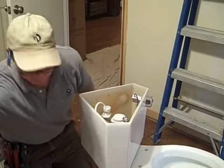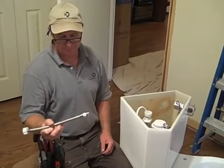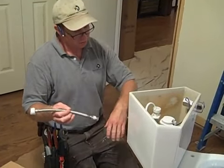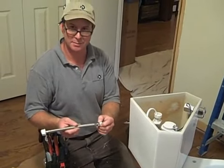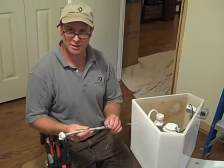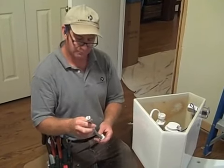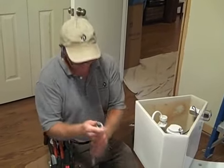The other thing we'll do while we've got the toilet sitting out here is attach the supply line. This is a supply line that prevents catastrophic flooding. Should this toilet run and run and run and overflow, or a line break, this has a little check valve in here that will stop water from coming out after so much. It's a good thing to use on toilets. They also make them for washing machines and pretty much anything that requires water. It's set up for a toilet tank on this end and a 3/8ths copper line on that end.